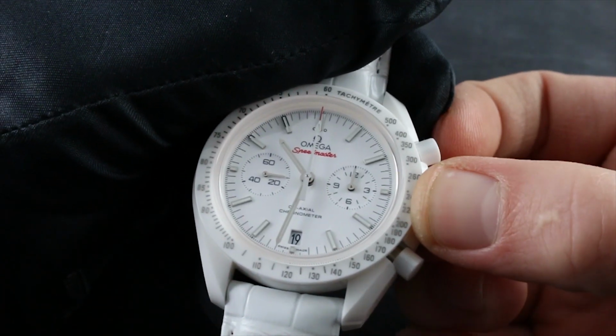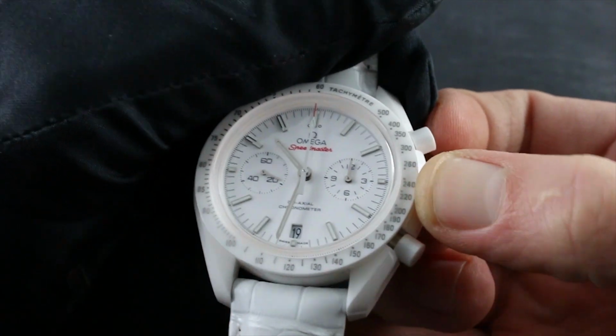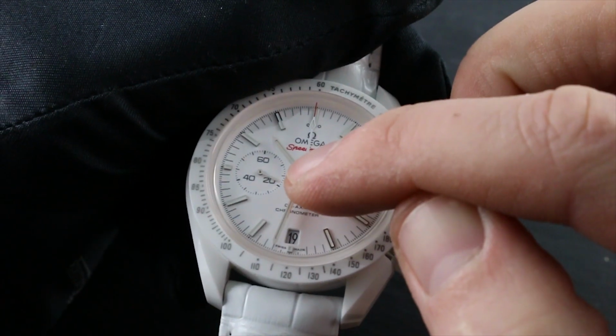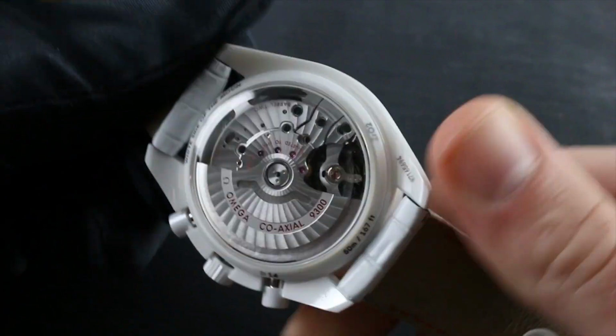Now, it's important to remember that the watch also features abilities to finally set the time and the date. Now, by pulling the crown to extremity, that is 2 detents out from flush winding position, you'll note that I stopped the constant seconds hand. Indeed, I have stopped the balance of the watch. It is no longer beating.